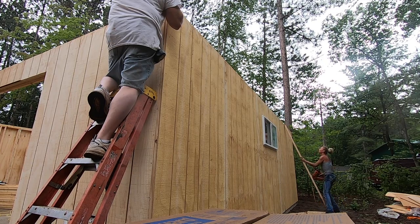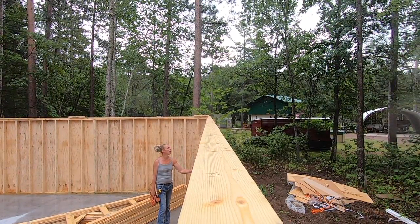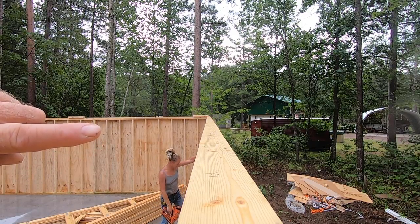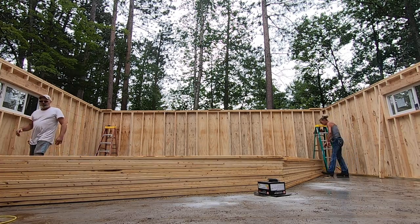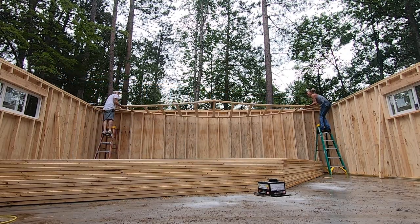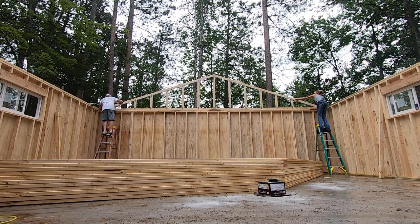After most of the groundwork is done, we straighten the walls to set the trusses. Put it right at the seam if you can, or right next to the window. Top plate seam. Oh yes, then the setting of the trusses. Such an awesome time. These happen to be 28 foot 4/12 common trusses. No room in attics or anything, just a nice simple build. I think the garage was 28 wide and 24 deep.